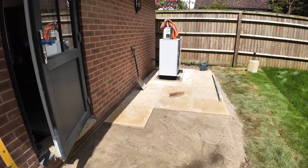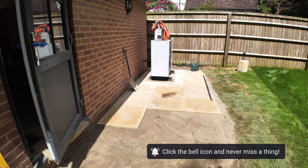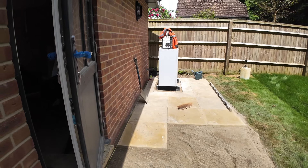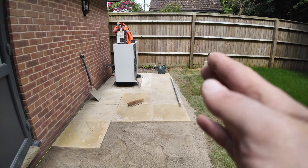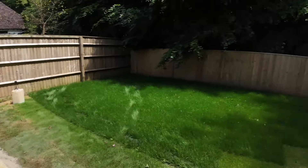Twenty to two — this is what we've done. And it ain't the best. I mean, they're rocking. We're taking them out, we're putting them in. I don't know how to get the level of the base right, to be perfectly honest. Need to Google it but can't get a reception here. We've got a line on the back of the house because I want to keep a 50 mil shingle margin all the way down the back, but that's throwing my slabs out. You can see the line here — the slabs aren't the truest. They're not the most expensive, but this line through here, as well, you can see two slabs in then it kicks over, although to be fair that slab is not the squarest.